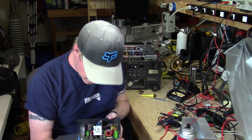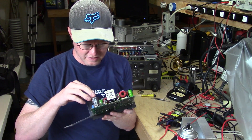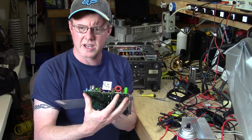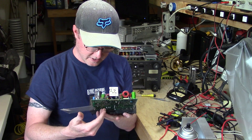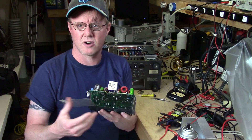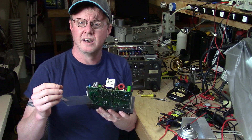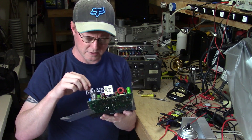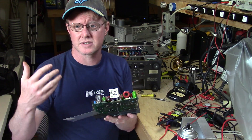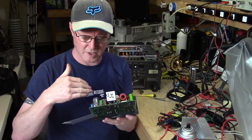One of the areas of this particular power supply I really want to look at are the diodes. I think if they're like the 2000 series, there are a couple of these diodes that are actually really sensitive to overvoltage conditions. I'm going to check those before I order any parts. I'll try to cross-reference those parts — generally with these semiconductors it's easier to order together since shipping is the main cost on smaller semiconductors.